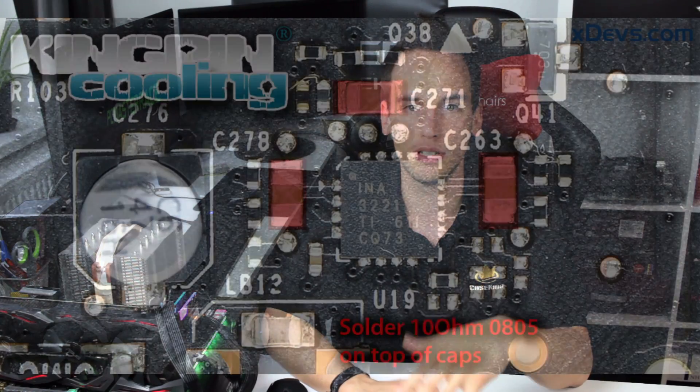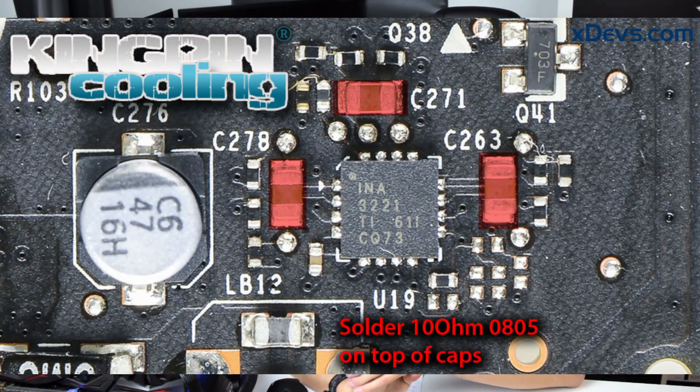Also found in that topic: people tried gluing small resistors onto capacitors of the Texas Instruments controller that measures power consumption, referring to a guide from 'tin' from EVGA posted on x-devs about the 1080 Ti power modding. That's actually a more elegant way to do the power mod, but it requires either soldering or being very skilled with silver conductive paint, plus you have to buy the resistors first. It takes more effort than liquid metal modding. That's it for this video - if you have any questions leave comments down below, and I hope you have a very nice weekend. See you soon!